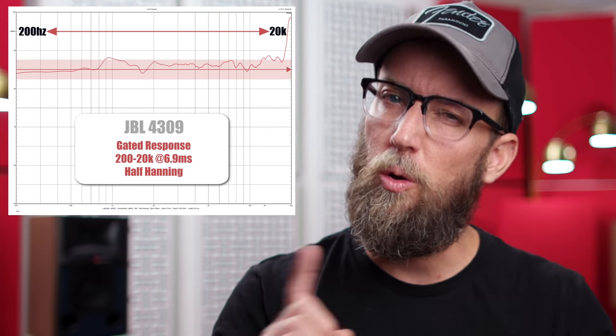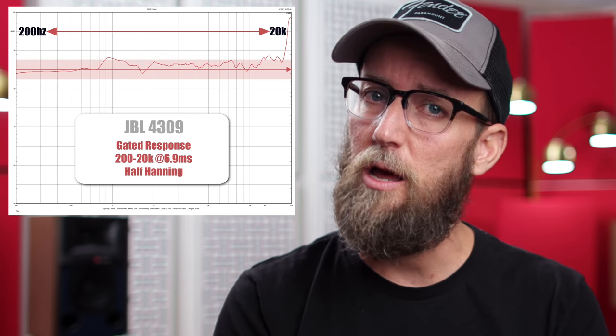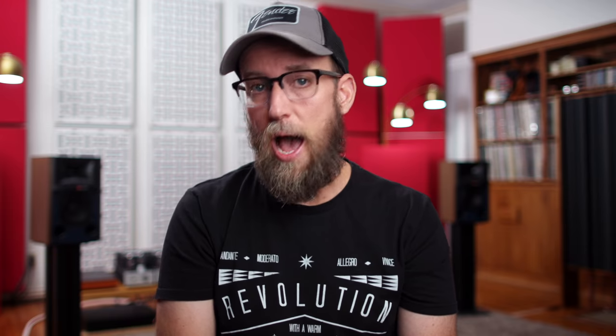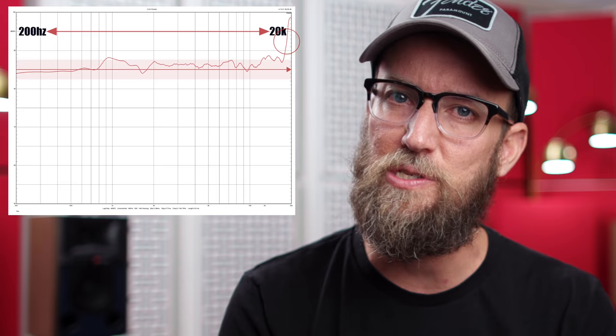Taking a look at our gated response, we can see only a couple of spots that drift from the five decibel threshold. The small rise between 900 and 1k appears to be the woofer's response at the crossover relationship. Way up high, way past the fundamental hits of cymbals, this HDI tweeter seems to be freaking out — and that peak is the same thing we saw in the HDI 3600s. Is this anything to worry about? No. That band is so narrow and so high, I seriously doubt you'll hear anything nasty — and for the record, I didn't. What I did hear, however, is balance. Snaps, cracks, and small intricate details punch through the mix. When the music calls for excitement, it's all there and it is always balanced, never tilted or exaggerated.